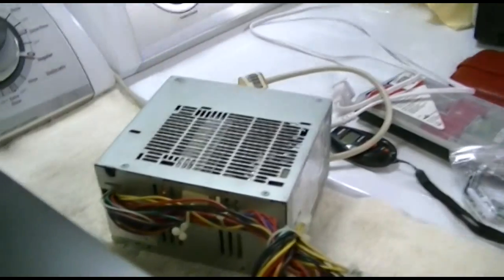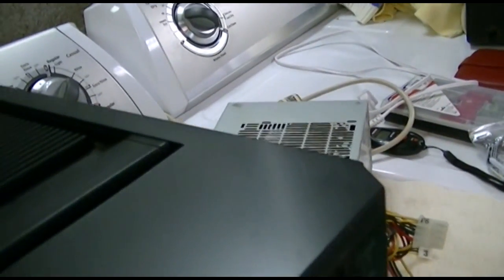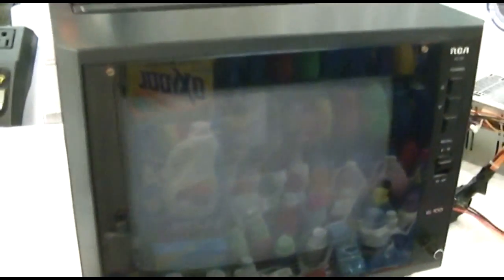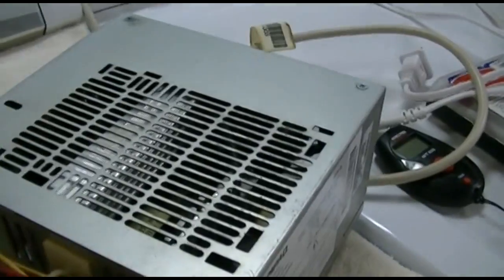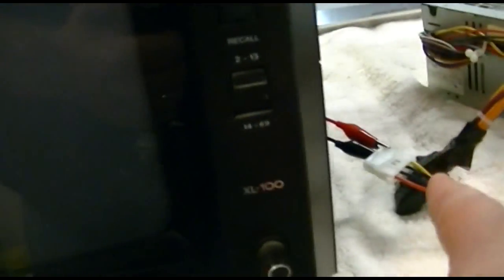I heard something but I shut it. The fan in the supply is kind of twisting around there, so let me switch these around. I have those switched around and I'm going to blip it again real quick this time, because I think it may have been right but it was throwing the supply into protection. Same thing. I have shut the TV switch off and hooked the wires back up the way they were. I don't know if you can tell, but the fan in there is running. I'm hoping maybe it can't start with such an immediate load on it. I did get crackling this way, so I think it is correct — we'll give it a shot.